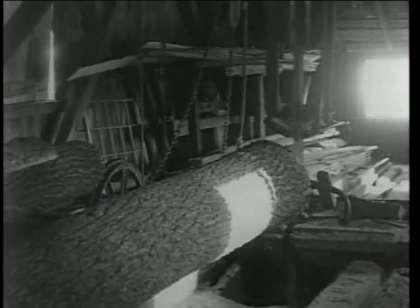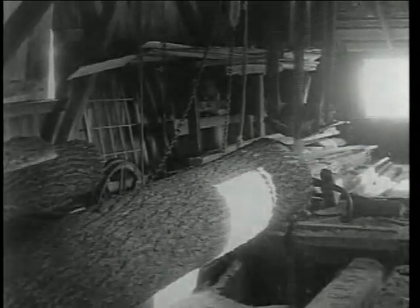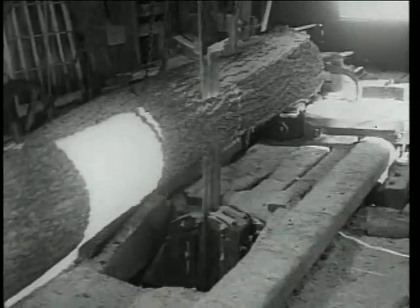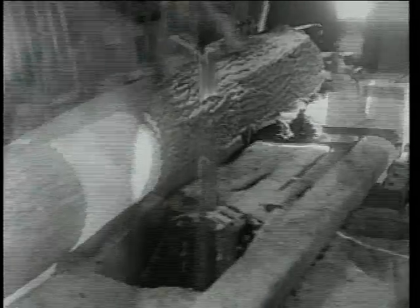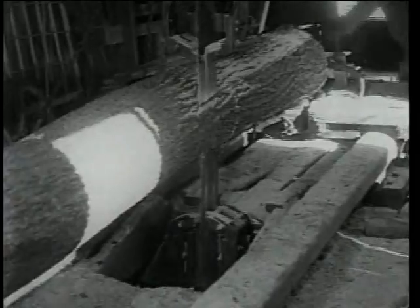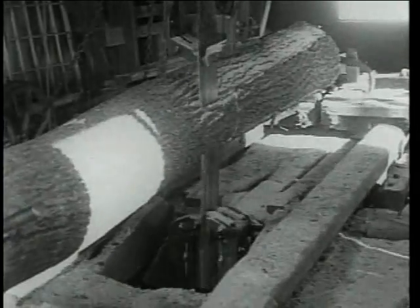The saw at Sharon Sawmill was an up-and-down muley saw. The muley is simply the bare saw running between and kept in place by guides. The best muley saw will make about 350 to 400 strokes per minute. The muley only cuts on the down stroke, chiseling wood away to make the planks. The muley saw does not move to cut the log, but the carriage in which the log rests travels along a wooden track, drawing the log into the saw blade.